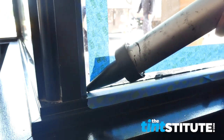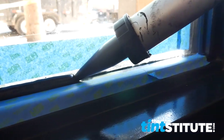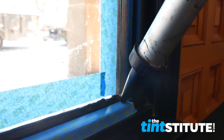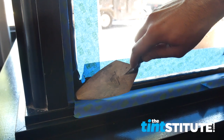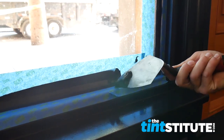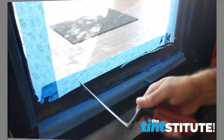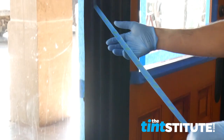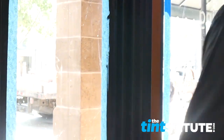I've trimmed the plastic tip of this at about a quarter of an inch — it takes some experimenting — and you can see it doesn't quite make it all the way to the tape but when I tool it, it does. This is just a triangle trowel from the concrete section of Home Depot and I've cut the tip of it at a half inch and rounded the edges with a file. This will take some practice, so I recommend if you do get a security film job that requires the wet seal, you want to practice on a separate window around the shop or even in your own home before taking it to the job, because it's going to take some practice even after watching the video to get the tooling technique down.